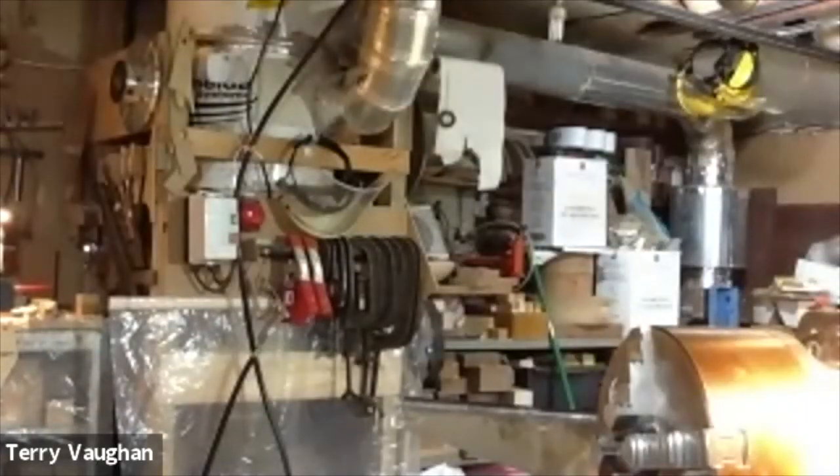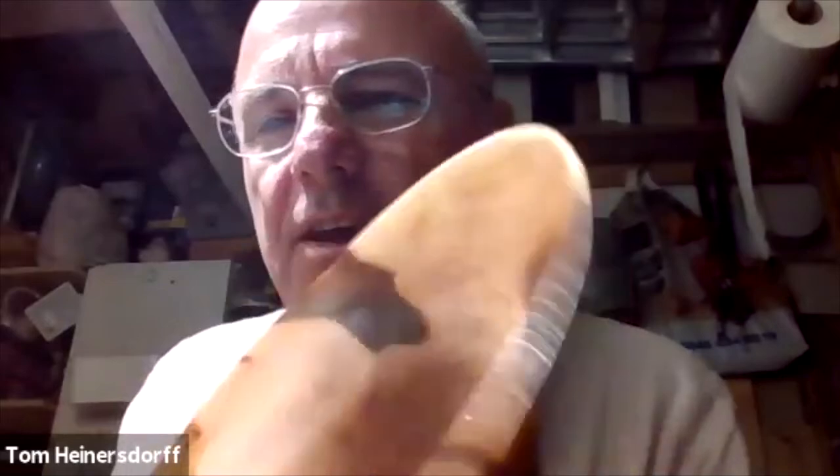It is mostly plain beech without much colour — mostly. Because the coloured part is spoken for. Well, that's not entirely true — here's a bowl I made this week. Can you see the colour in the centre? It's still a bit soaked in oil. Actually I was showing you the apple log — this is the beech. There's the colours there. What's the diameter of that? Roughly ten inches I suppose. It turns very thin too — about three mil, maybe four. It's obviously very wet when you get it — green wood, absolutely dripping — but it's dripping now with lemon oil to try and make sure it doesn't split. I just need to give it a final sand and then it'll be ready.